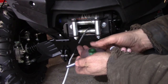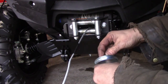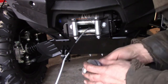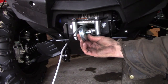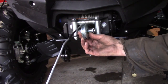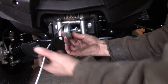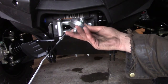I'm going to put that nylon bushing in there and it's going to get squashed into this deal here. Not a fan of nylon. Although the cable should be running straight out now, the way this kit is set up it might end up going straight up instead of at an angle, which would just chew that bushing right up. I think it'll be straighter, but why wouldn't they just use a bearing?